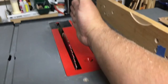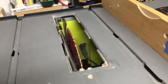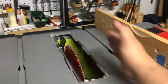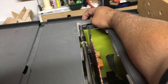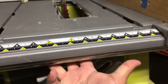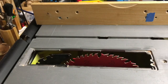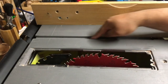The way to adjust the motor or blade — the blade with the arbor and motor — and make it parallel to the runners is via two screws: one on the back and one on the front. They're underneath this area right here. I'll show them to you in a little while. Let me show you what you can do to align it if for some reason it's not parallel to the runners.